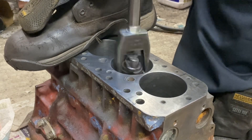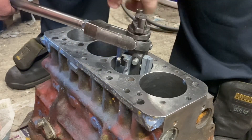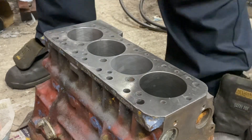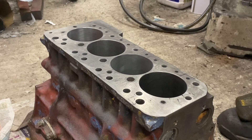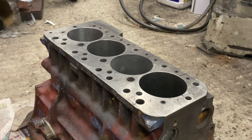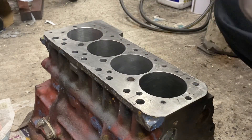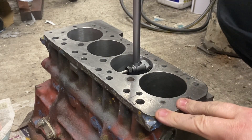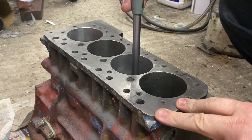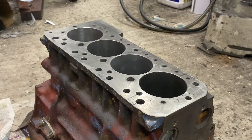Doing a lot of middle honing here, because we have to remember the middle of the bore moves away from the honing head because its wall is so thin. We check our progress as usual, remembering that the reading is going to give us the apparent bore size because it's now warm. Yeah — a little bit more and we're done.